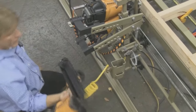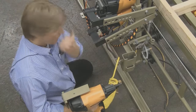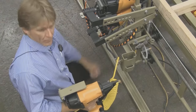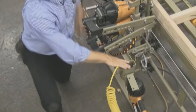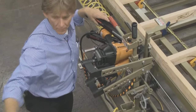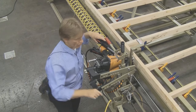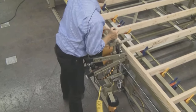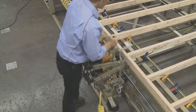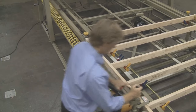The dollies — manual or auto — come with a spare gun that mounts to a spare mount we adapt to it. Send us at least six guns if you're buying a set; ideally eight guns from whoever gives you good service. There's also a clip here where you can put additional nails. You need this so a guy's not walking off the job outside his physical area — remember, he should have a six-foot rope on his leg so he's not traveling too far. If you've got cripples or fire blocking to put in, pick up this spare gun, go in and toenail, get it done in place, put the gun back, and the guy just goes right down the line doing the same thing.